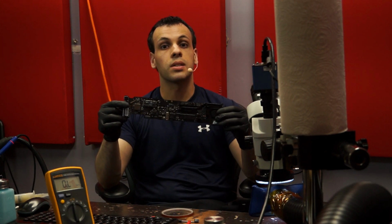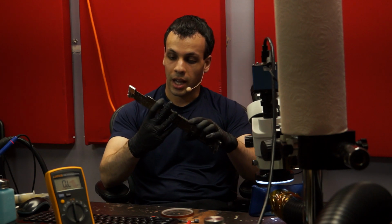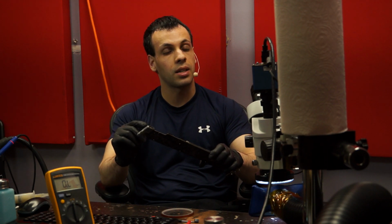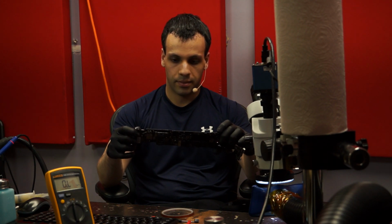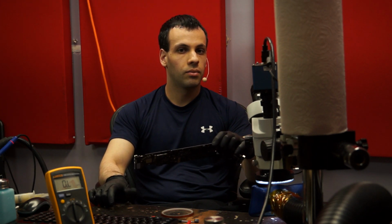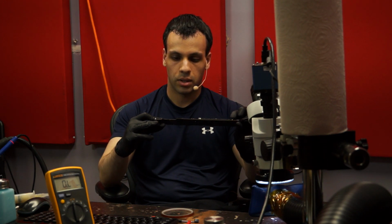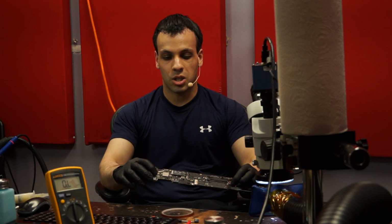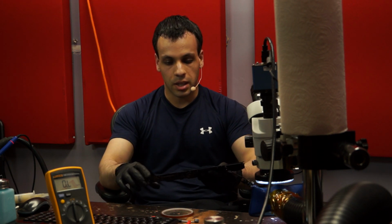So the issue with this is that SMC reset L wound up being missing, and we had PP3V42. PP3V42 was here. However, after we realized PP3V42 is there and that SMC reset L was missing, we replaced the IC, which looked like it had wine on it, for SMC reset L. At that point, we can then assume that the SMC is what is bringing the signal down, which is what's been happening more and more often lately. So we replace the SMC, and it works.